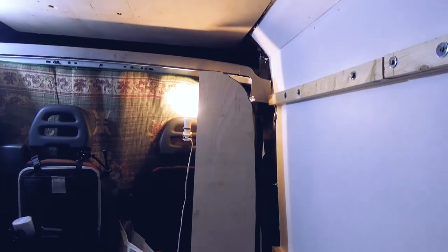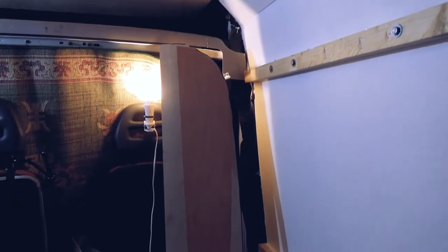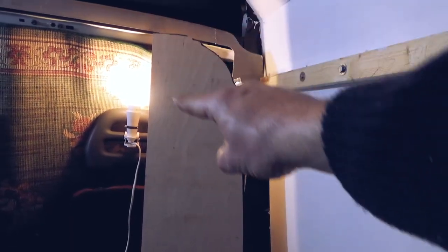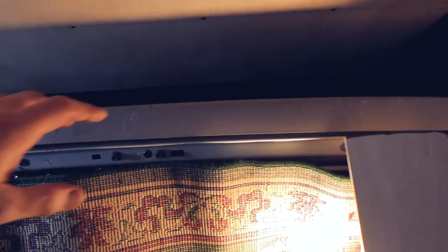What I haven't shown you before is a trim for the bulkhead. It's not the finished article because having that straight edge is ridiculous. What I did was use the bulkhead as a way of creating that curve — not easy to clamp anything to. I clamped a much thinner piece of ply close to the edges and then transferred that line to the thicker ply and cut it. Once I've got it bolted in there I'll be able to trace the shape of the plastic trim and the two will sit up against each other.